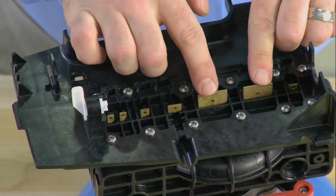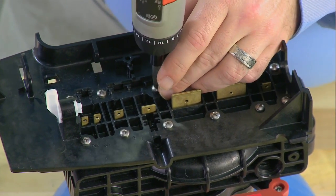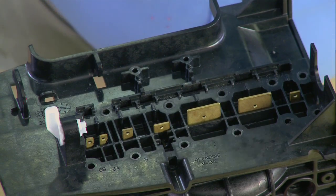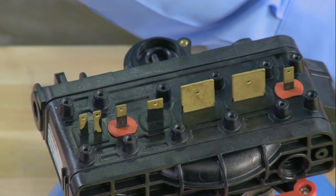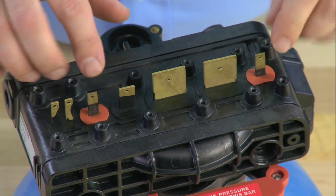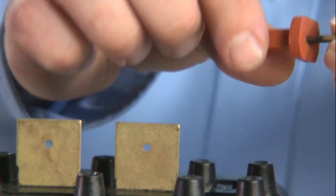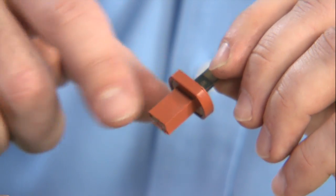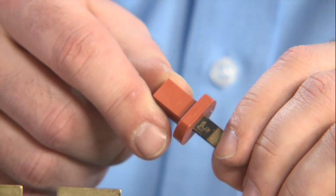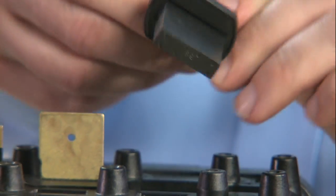We then have access to all 12 of the top plate screws. All of these need to be removed in order to get access to our valve discs. Once we have all of the screws removed, we can pull the top plate straight up. That gives us access to pull each of our individual valve discs up. The sealing face is the side closest to the injector side of the body. We want to inspect this to make sure there is no scoring or damage to the face or to the top seal. If there is damage to any of the valve discs, we recommend replacing all of them.